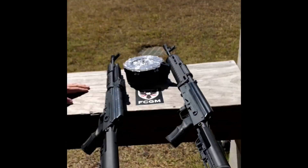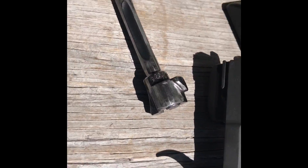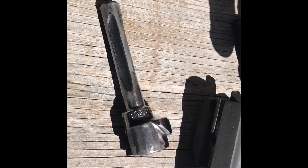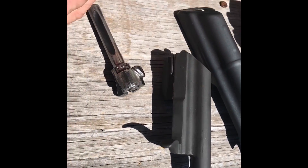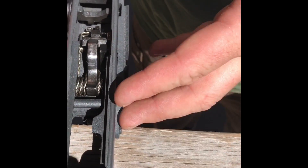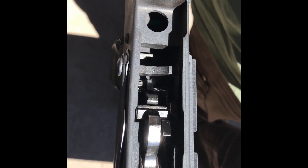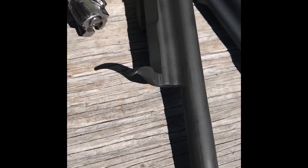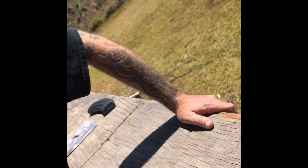Tommy did a lot of work on those — it's a one-off gun. We did not paint the critical components. We do a manganese parkerizing — it's a chemical process — and that parkerized finish is actually underneath all of the Cerakote paint. It's the absolute best finish you can put on a firearm. And there's a little bonus — eagle engraving on it, Mission Number One.